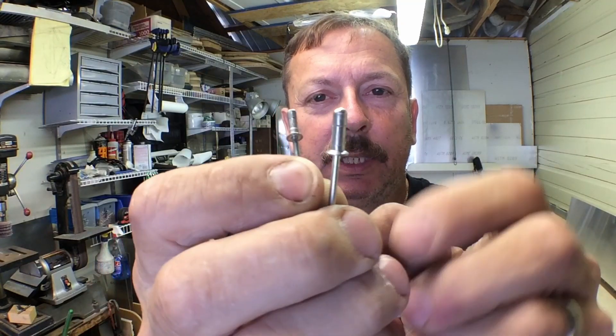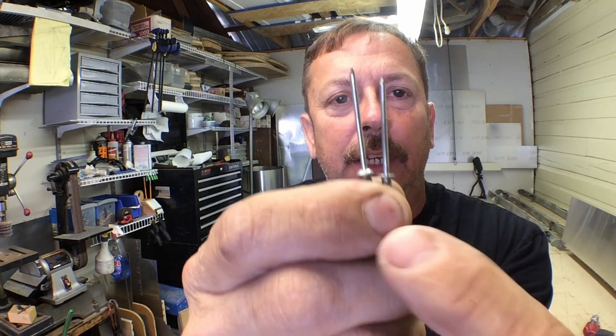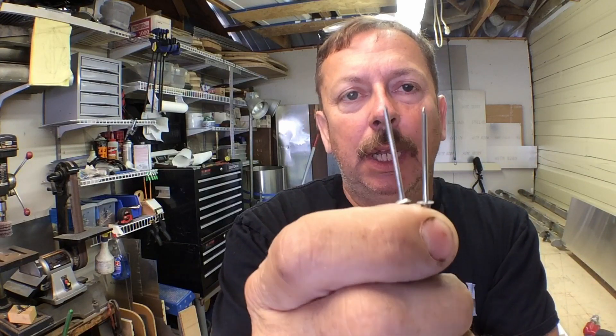The A4 and A5 rivets — Zenith actually calls for a countersunk rivet. Here are both an A4 and A5, and you can see it better on the A5: it's designed so the skin can be either dimpled or countersunk for a flush rivet. Zenith has changed that design to make them structural by doming the head. This one's partially pulled just to show how they've reformed the head — a dome on the outside squeezes down onto the skin for more holding power. I've done a video on that and will link it in the description.